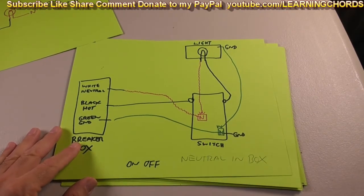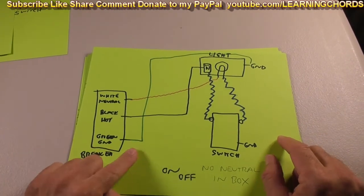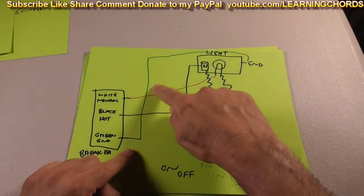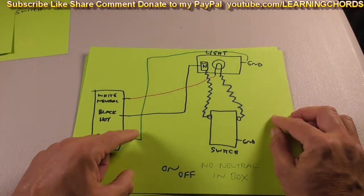So now I'm going to show you the other way that they wire this, without the neutral in the box. Same circuit, kind of. We have the ground. The ground could go straight over to the light. The ground could go into the box and then over to the light with wire nuts. I just showed it going straight to the light.